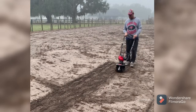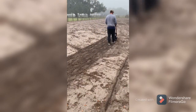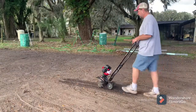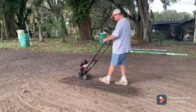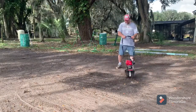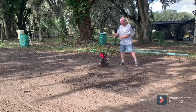Here I'm showing a couple different methods I used with this tool. Going forward slow seemed to be okay, but I got the most effectiveness by using the tool going backwards — whenever I would start forward and then drag the tool backwards, that's when I would get the most out of each pass. For the high spots, I found I was able to use it kind of like an old floor wax machine, sliding it back and forth to smooth out the high spots and bring them down to the level of the rest of the arena.